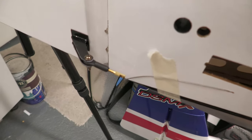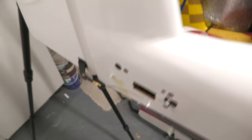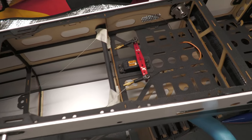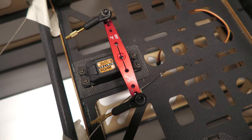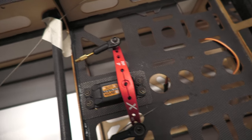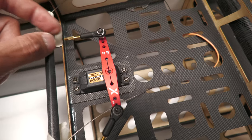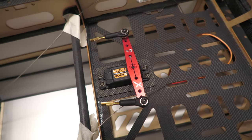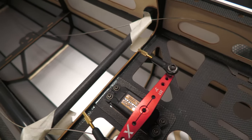I've attached the ball link and the closed loop connection on both sides of the rudder, and I've put in the rudder servo — using the same Savox as in the wings — and connected the three-inch arm, which is what's recommended. The linkages on this end are connected too. I haven't done the closed loop yet, so I'm going to show you quickly how I do it — I've covered this in one of my other videos, but I'll show you this one.